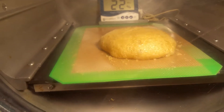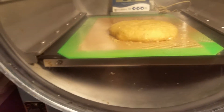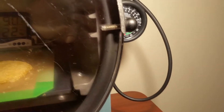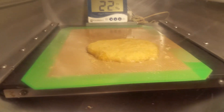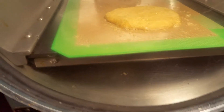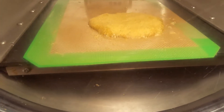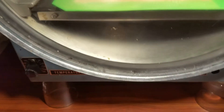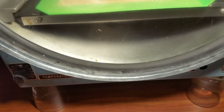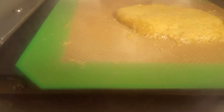Now it's collapsing and my vac system is not quite at full — it's almost at full vac — but it collapsed and it splattered a little bit. Notice the splatter, that's kind of interesting. We'll let this run all night. I might have to add a little bit more oil because that pump doesn't quite sound right, but in a dry run this thing actually held all the way to 26 — two hours later. So it's got a tiny little bit of a leak somewhere, but it held. We are now at full vac and we're just gonna keep pulling on it.